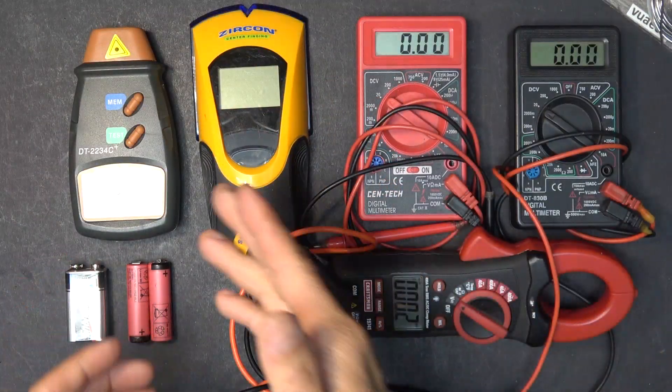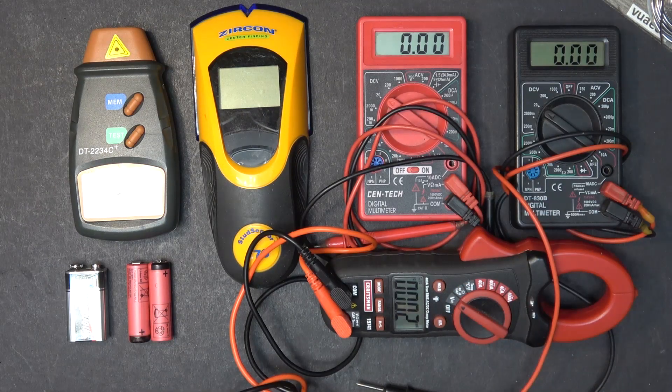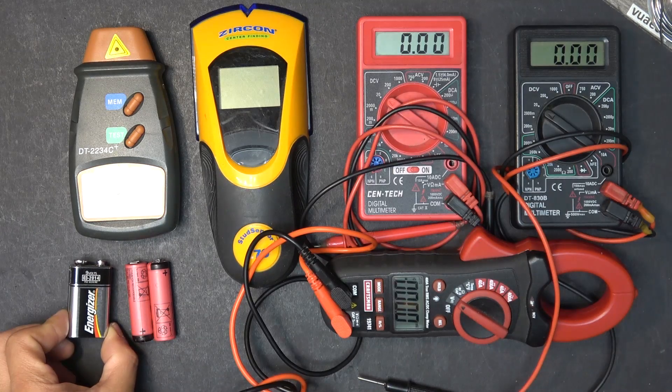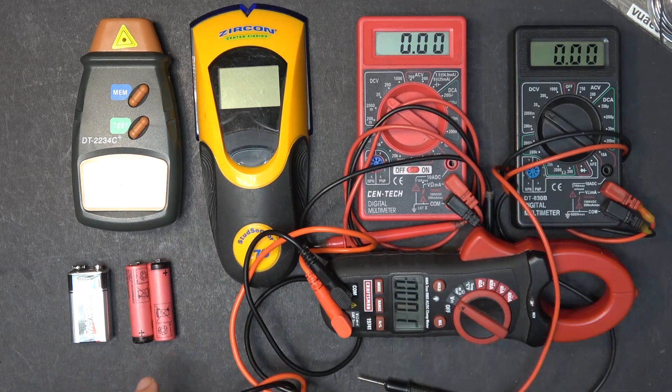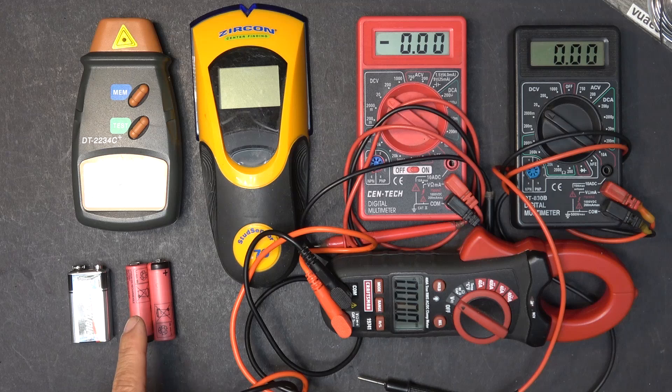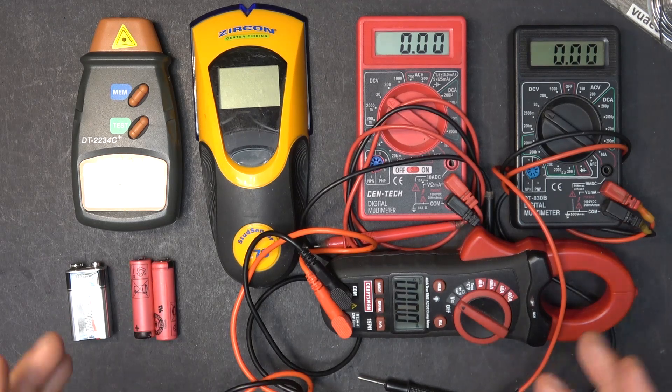So there you have it — I have converted all my 9-volt power devices to lithium-ion batteries, from $1,000 per kilowatt hour to zero dollars per kilowatt hour. Of course I still have to pay for the two 14500 cells, but two of these is still cheaper than one single 9-volt battery if you know where to look. As for capacity, a 9-volt battery is about 500 mAh, while two 14500 cells at 8.4 volts together give 740 mAh — about one and a half times more. So not only do I have free power with these, I even have more capacity. Thanks for watching and we'll see you next time.